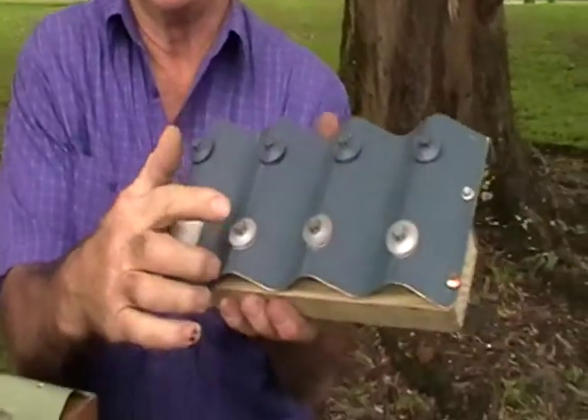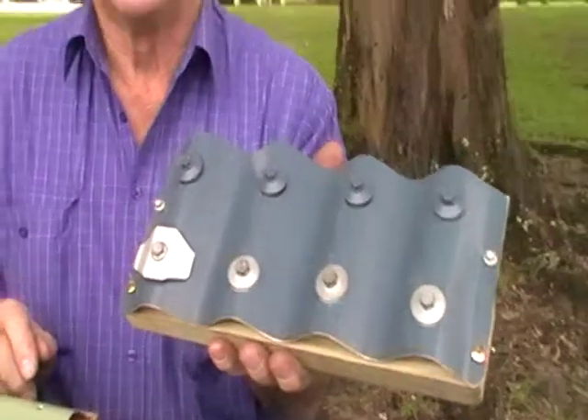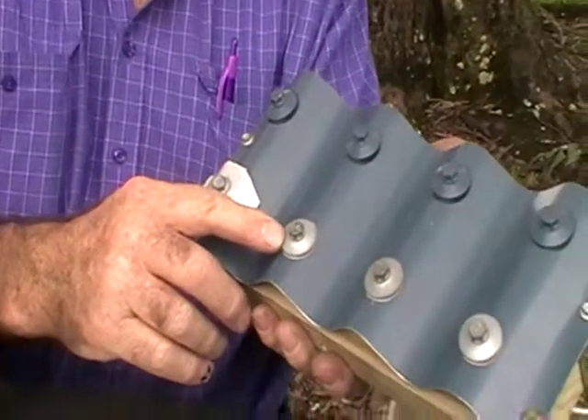Okay, the majority of product that's put out in the marketplace has a head marking, and the head marking goes on top of the head, like this. Action Fasteners has C3 and C4 head markings. BuildX has B with an X, Bremming has B with a 4, and all the other various manufacturers or suppliers have their own head marking. Anything with a C3 or a C4 is produced by Action Fasteners. Thank you, Gary.